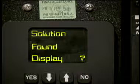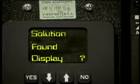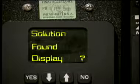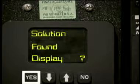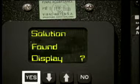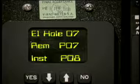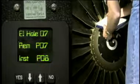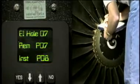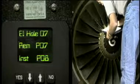After a short time, the solution found display will appear. This screen tells us that there is a balance solution for the fan. When this screen is displayed, push and release the yes button. This will cause the AVM system to give us the specific balance weight and its location on the rear spinner to balance the fan. Using a piece of paper, record each new balance screw and its location on the fan spinner. Use the down arrows to read all 36 locations.